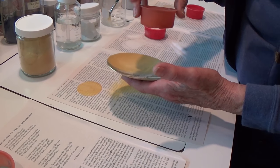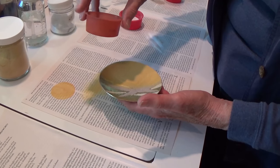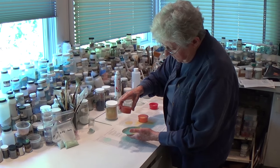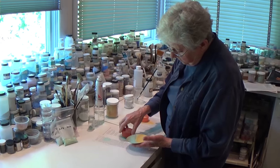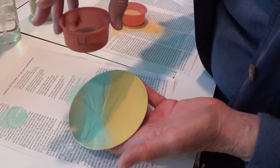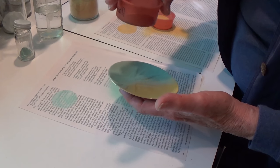You don't want it running, but you want it damp. It's a beautiful kind of golden brown color — you can see it's going to be rich. Then I have a pale green that I'm going to sift on the rest of it. Same process: sift, spray. The trick is to stop when you're done. If I can't see any copper showing through, I know it's got enough enamel on it. That's a rule I've followed since I began enameling over 50 years ago.